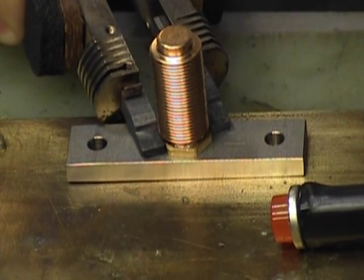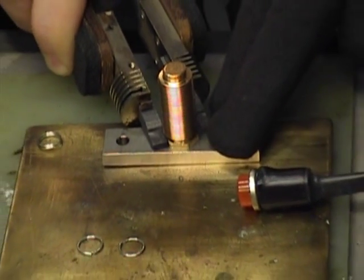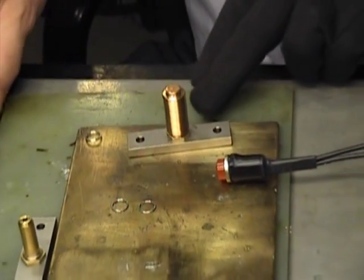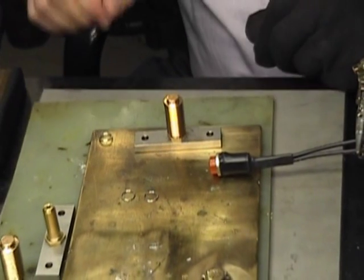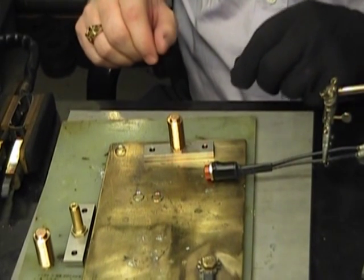The bellows were sitting in the liquid solder so I've got good saturation and good wetting. It's going to take a moment for this to cool off because of the amount of mass that we've heated up, but when it cools we should have a very nice hermetic seal in this assembly, and then they'll test that when we send these back to them.